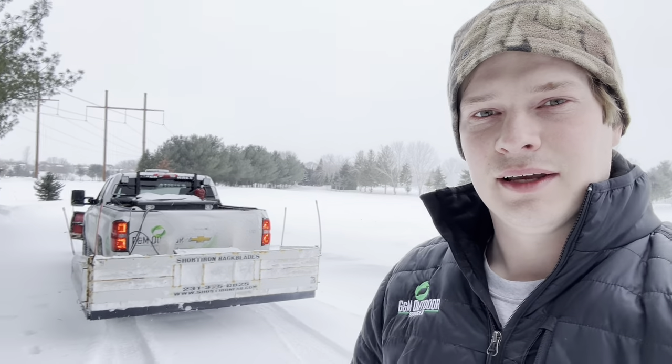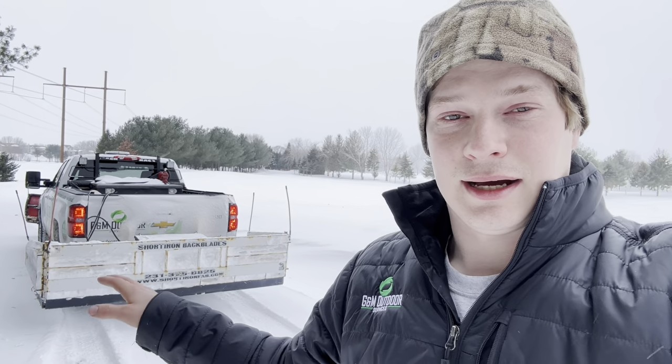So here's my opinion on the perfect setup for plowing just about anything. If you're plowing with a truck — a V-plow on the front, believe it or not — because when you have your back plow, the V-plow V's, stays closer to the truck, and then you can stack and stuff. This setup right here for plowing commercial and residential works good for everything. Back blade on the back — SnowPower, short iron, Eblings are okay, there's a new Boss 180Z, and a new one called Defiance that actually windrows. If I were to start all over I'd get a Chevy truck, V-plow, and at least a 16-foot back blade.